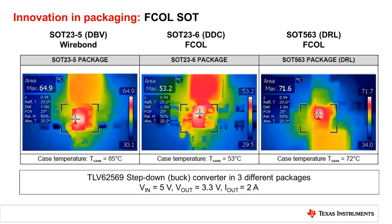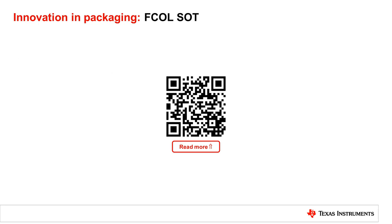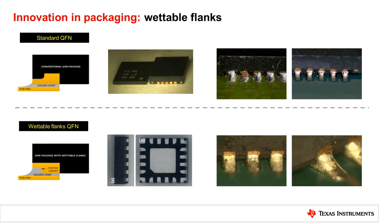At the same time, it helps the IC remain cool. Automotive applications require high reliability. Traditional QFN packages have risks of limited side wetting and poor soldering on lead.